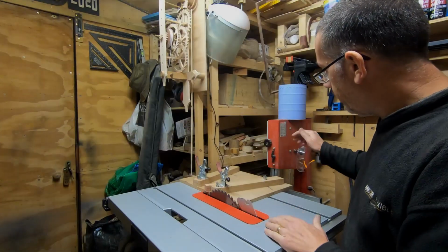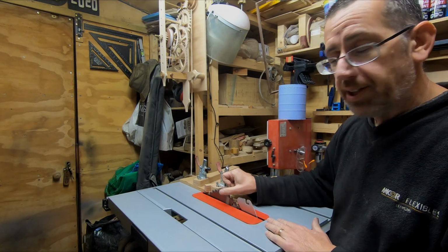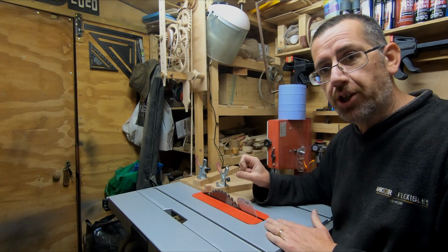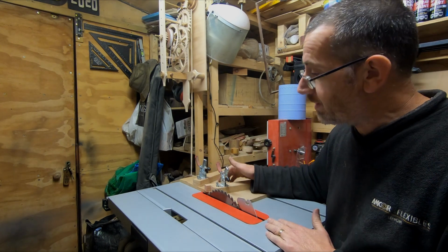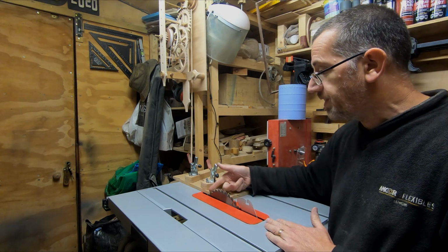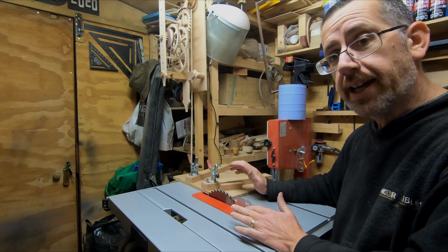and you don't see all this front of the blade. When you use something like the bandsaw, because the bandsaw blade is solid and it's one thin blade just going down, you can constantly see that blade all the time, precisely where it is, so you know where you can sensibly put your fingers. With this, doing it this way, as I say, it's a bit of a blur. You don't actually see all this front edge. You probably see the top here, and that's why that happened.